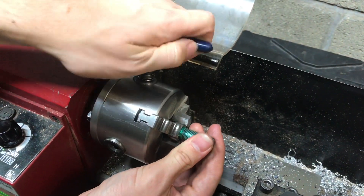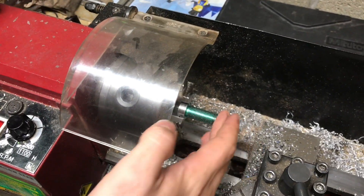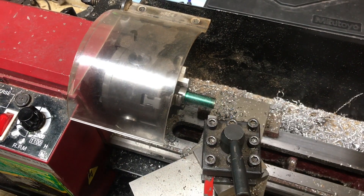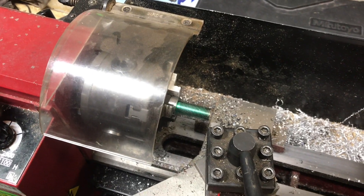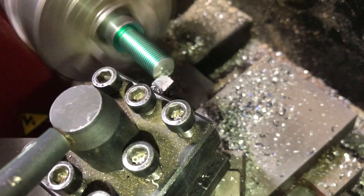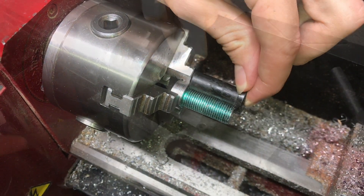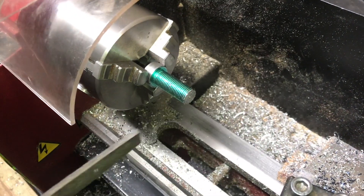Now I shouldn't have wobble when we come back around to this side. Wow, that's a huge difference — it's all straight. So the first thing I'll do is set this up for a facing cut, which just means I'm going to bring my tool this way a little bit so that I have more relief on that edge. It is sticking out pretty far; I might get some deflection, but I'll go ahead and cut it because it doesn't need to be anything precise. Beautiful finish there, but we didn't really take that much material off — that's a good length. Tool height is pretty far from center, and so that left that little nib there. I'll go file it off and also deburr that edge.